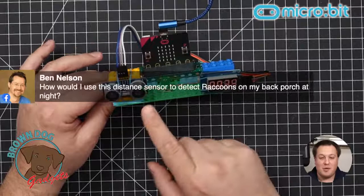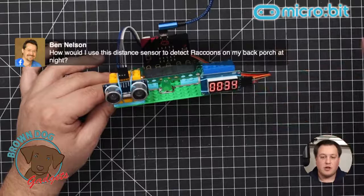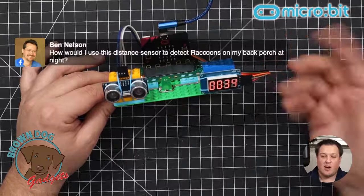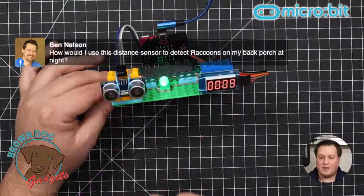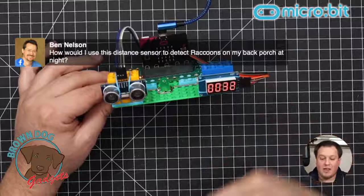But you could use this to, say, do a blinking LED. Output a sound effect. Say Halloween, you put this plus a little piezo speaker to do a sound effect. Or we've often used an MP3 player module. Again, a very inexpensive thing. We use that in a couple of our projects, like our HAL 9000 project, our sound wall behind me here. So if somebody comes within, between 1 and 10 centimeters, it plays that MP3 file, a spooky sound effect. Maybe you want to have it at a certain distance activate a big vibrating motor to make something shake next to you, or a lighting effect. So there's a lot of things you can trigger with that.